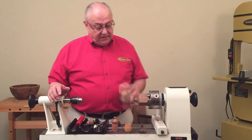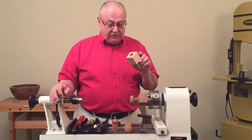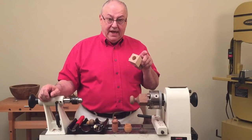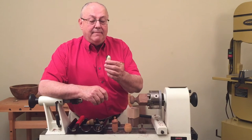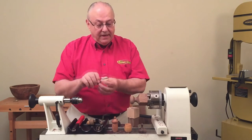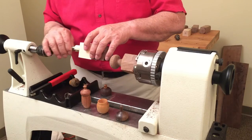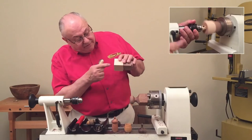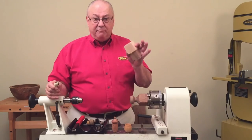Now we need to do the nut part of it, and we have a similar issue. On this, a round bottom is preferable to a square bottom. A square bottom is what we get when we use the Forstner bit. So I was looking around in my toolbox and I came up with a round nose router bit. The beauty of the round nose router bit is that in one motion we can install this right in our drill chuck. In one motion I'm going to get the perfect hole with a perfect round bottom. I don't have to fish around in there with a scraper and worry about a catch — goes in, goes out, perfect every time.